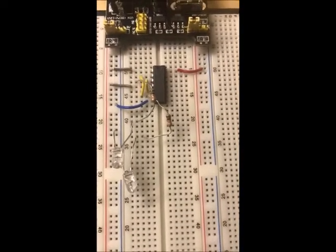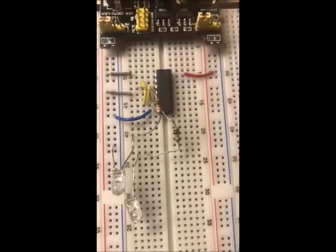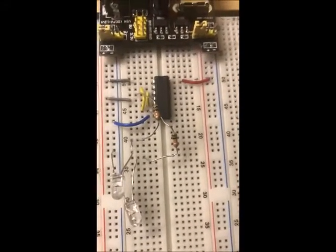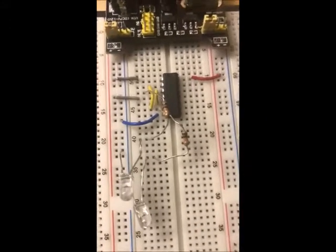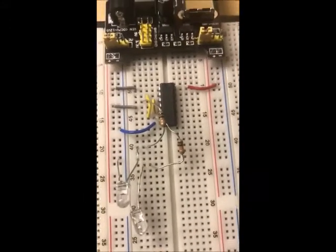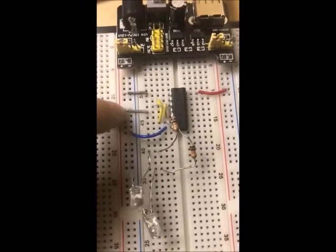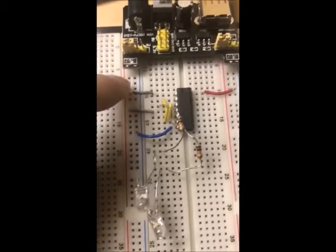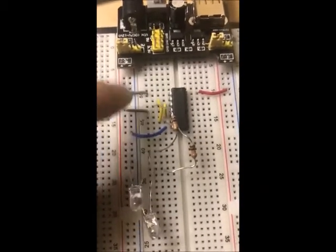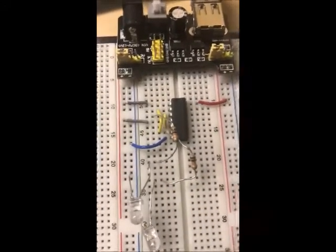The main problem with this lab was that I remembered in class we used 2 NOR gates, and with the NOR gates, the hold or no change state was when the two inputs were 0 and 0. However, I didn't realize that the NAND gates would make it opposite, so that 0, 0 would be the unnatural state, and 1, 1 would actually be the hold state. So that took some trial and error before I realized that, and that was the problem I had.